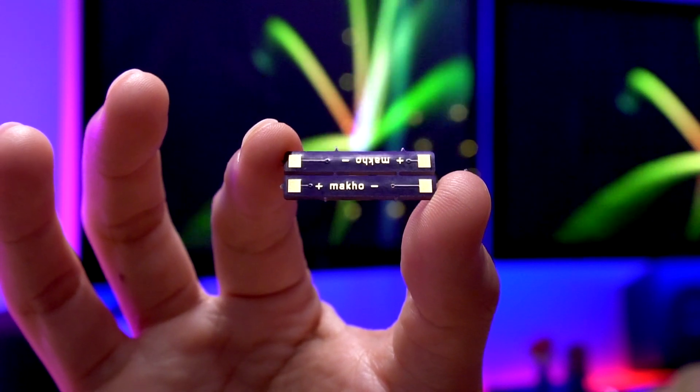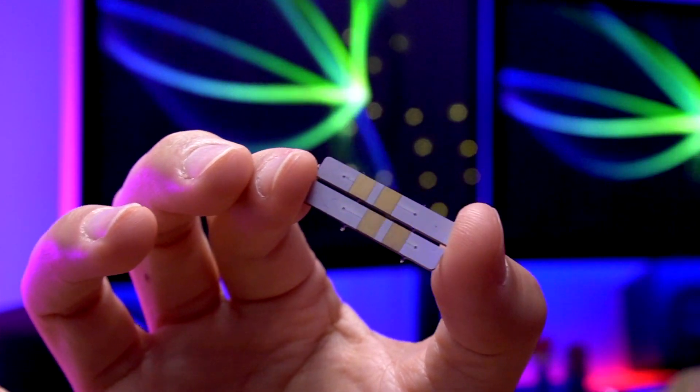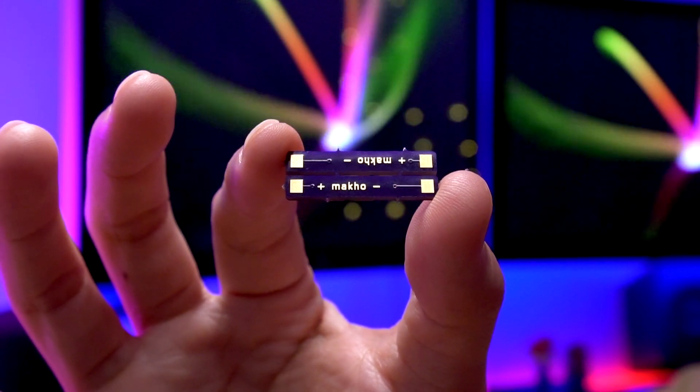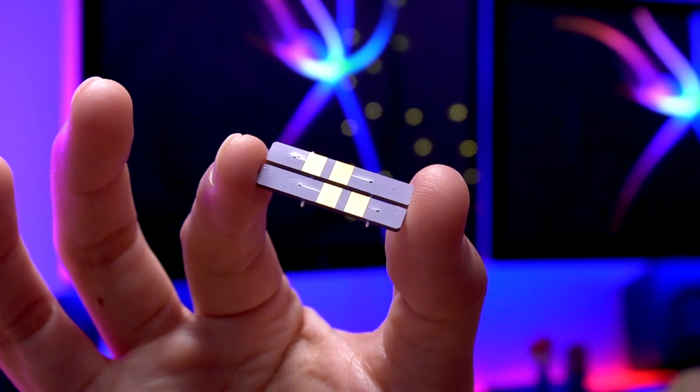The last item you're going to need is the Game Boy Advance SP battery board, designed by Mako. Mako has a fantastic YouTube channel where he does a lot of Game Boy mods and is a great contributor to the community. This is a really cool little PCB — essentially it allows you to install these lithium polymer batteries into the Game Boy Advance SP. On one side, you solder the wire leads from the battery to the pads marked positive and negative. On the other side, there are the two battery contacts that touch the contacts in the Game Boy Advance SP battery compartment. I have links to everything in the description below. Without any further ado, let's get started with this mod.